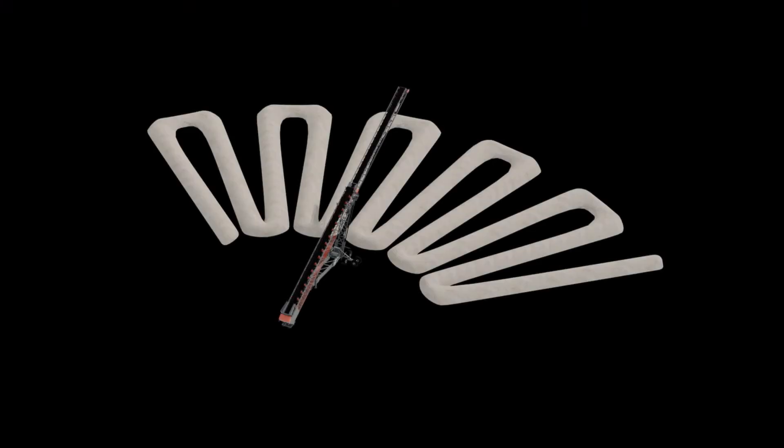For small areas, inline windrow tends to do well. The motion is to extend the stinger and then retract the stinger back using constant stinger motion. It allows you to build a lot of volume without getting a lot of radial motion.